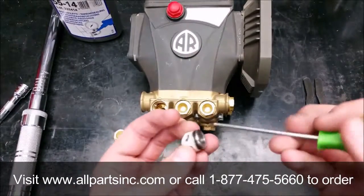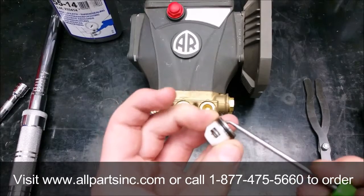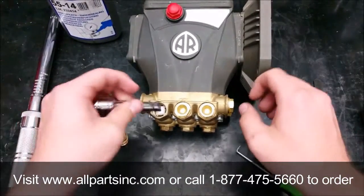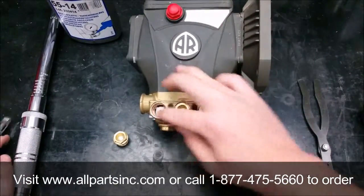Before you put in the new valves, take a small tool and test if the poppet is working properly. Make sure the valve is square in the port. A 3/8 inch socket extension can be used to seat them.